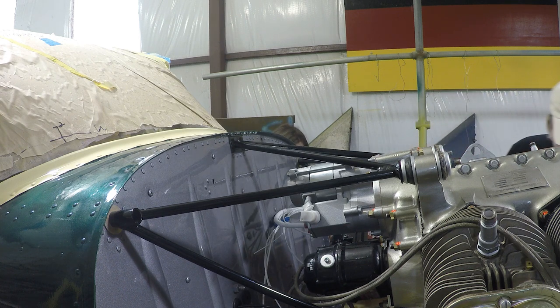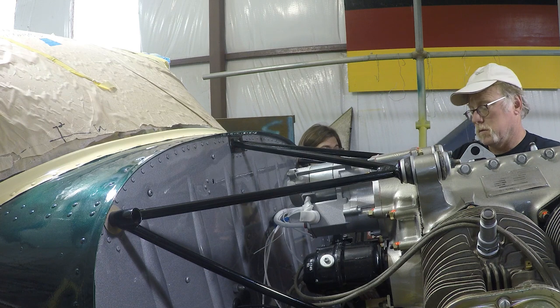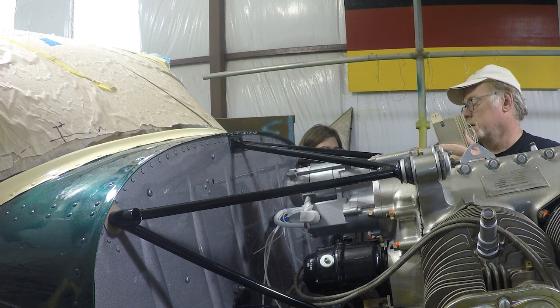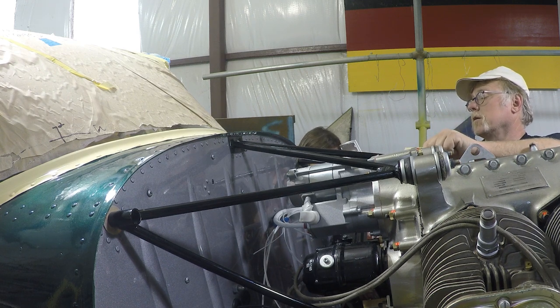A to B. You gotta show A to B. Oh, yeah, let's show the difference. So, what we're looking at, how many more inputs, size wise? Size wise, we have battery, armature, field, standard generator. And this one here, we're gonna have ground, field, enable, aux, lamp, and sense. But I think we're going to be using the ground, field, the enable, lamp, I believe.